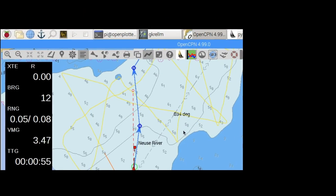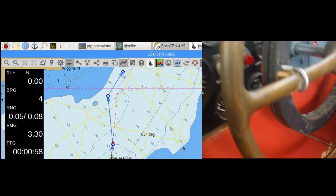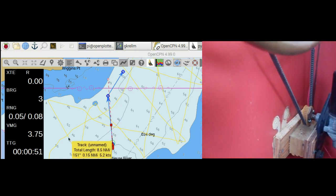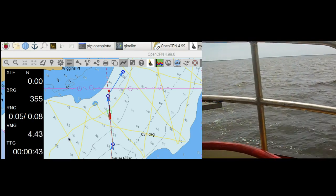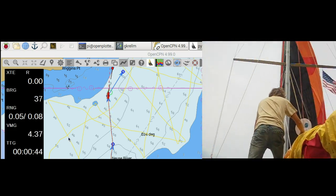The standard route logic in OpenCPN uses cross track error, which is difficult to tune and doesn't always work well. I am using the autopilot route plug-in, which I developed especially to fine tune the parameters used for route following.